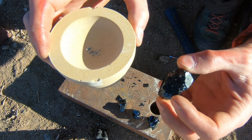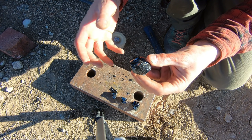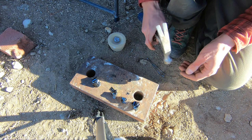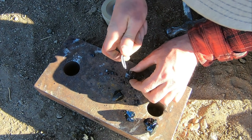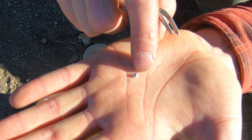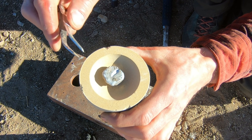I've already plucked these out of the slag. One way to do it is run this stuff through a crusher and pan it real quick. Here you can see a piece of slag with a couple little BBs. I lightly hammer it — you can see that BB just popped right off. Sometimes there are some pretty decent-sized ones in there, so it's definitely worth pulling them out. We add them to the coupelle.